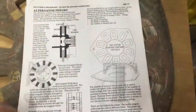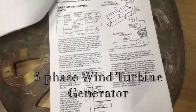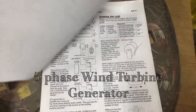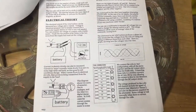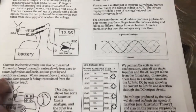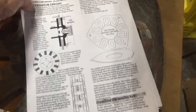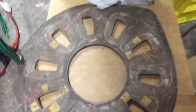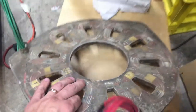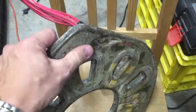Next on the list is the wind turbine project. This project I started a long, long time ago. I must have downloaded the paperwork online — it's pretty descriptive and takes you step by step through how to build a wind turbine. Why five-phase? Well, just because I can. So far I've built my stator, which consists of ten coils cast in resin, already all wired up and ready to go.